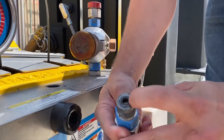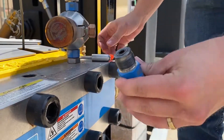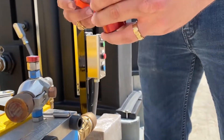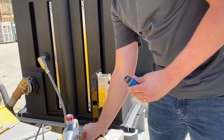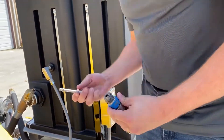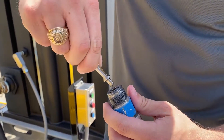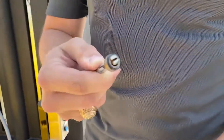There's our pill seal. Looks like that top face O-ring looks pretty good. So now we're going to remove the pill seal. You can do this by using a pick, a hook pick, or a pill seal remover. We're going to use the pill seal remover — insert it there and pop it out.